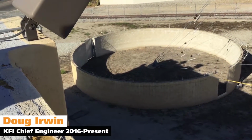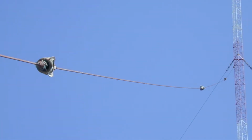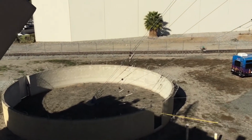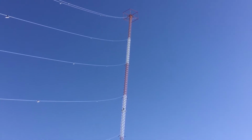If you see each of the egg insulators, you see a device that is hanging around, and that's actually a static drain choke. So it keeps voltage from building up on either side of the insulator, because we had a problem before with arcing across the insulator. So now that those static drains are there, problem eliminated. And what about these things? Those are, oh, that's more of the same. Those are more of the static drains. Just each of the guy lines has got multiple static drain chokes on them.